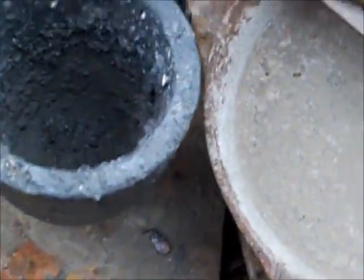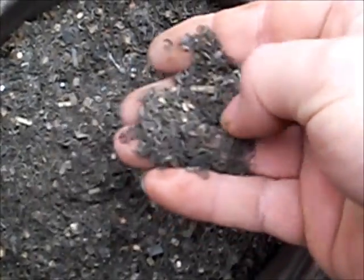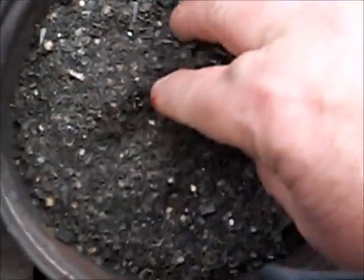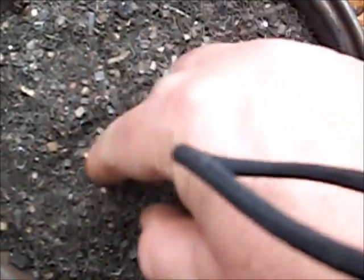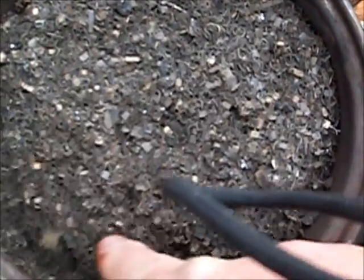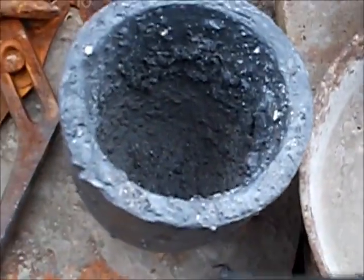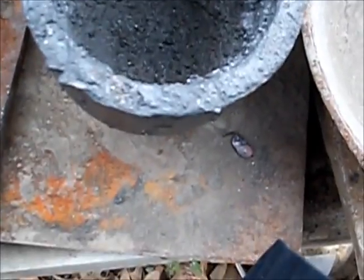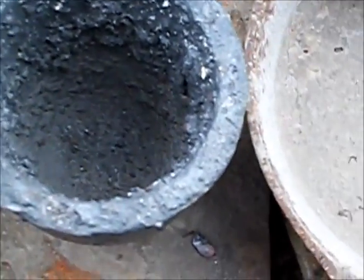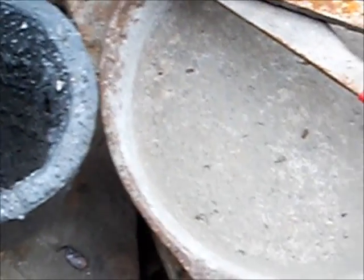This is my source material and this stuff is copper. I've removed the steel magnetically, and each one of those little pads has got some silver — it may even have a little bit of palladium. Each one of those little silver-looking pads is actually a silver pad. But I'm not going to try to refine it because I had it tested — I took a sample and had it assayed and it was less than 1% silver. Even at a hundred pounds of it, a hundred pounds would only come back one pound of silver, and it's just not worth it. But I can get number one copper ingots if I melt it and pour it up in little pancakes. So that's what I've been doing.